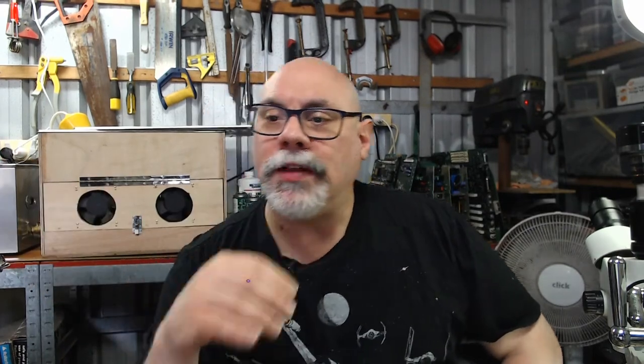Right, let me just have a quick look here. An SE30 that I got about a year ago, originally it had a pretty bad flicker. Okay, now they've sent me a picture of that flicker, but so I decided to recap it. After the recap, I was getting horizontal lines and a death chime, okay? Pretty bad at soldering, and the caps I got were slightly too big for the pad, so they overhanged and weren't quite sitting right. So asking me to have another crack at it, see how we go. So that's all fine. The fact that it did work before they recapped it is very promising. That's always nice to know.